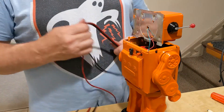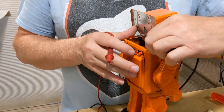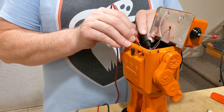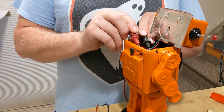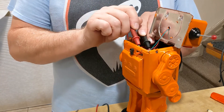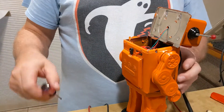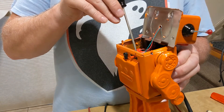I'm going to check the voltage. Chances are this thing has a lot of problems. I'm getting three volts at the battery connection, but when I flip the switch I don't get any voltage. So it could be something as simple as a bad switch — I've got three volts on one part of the terminal but not on the other. I'm going to try bridging the switch connections with a screwdriver to see if it comes alive.